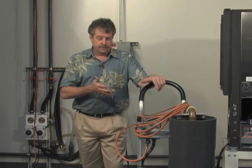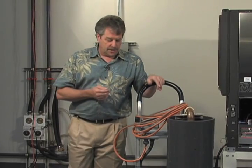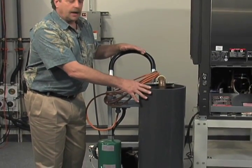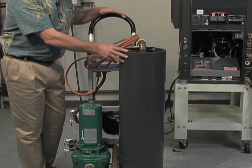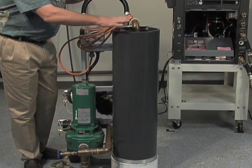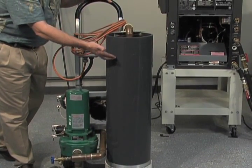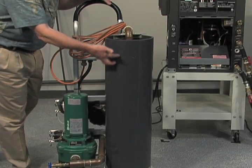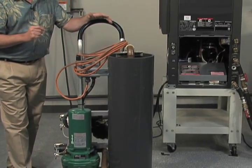I'm going to walk through some of the features of this flush cart. For example, we have a 10-inch diameter tall piece of PVC pipe. Obviously, it's got a solvent weld cap on the bottom of it. It is 40 inches tall, 3 foot 4 inches tall. Again, this is 10-inch diameter. One of the key components is you must have vertical height so that the return air bubbles will rise to the surface and dissipate. More on some of the internal components of that in a moment.